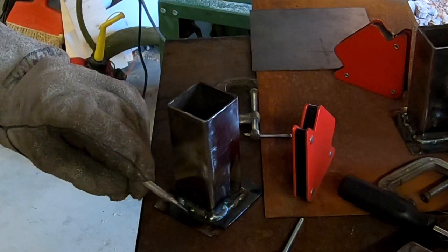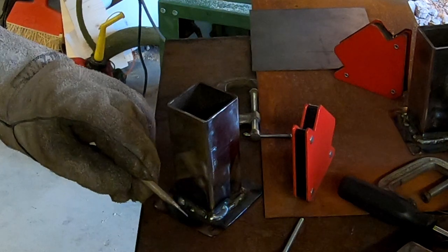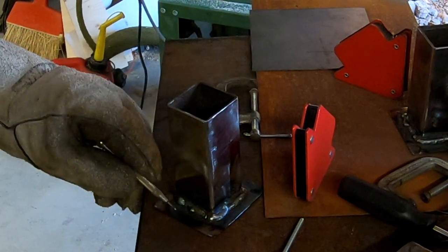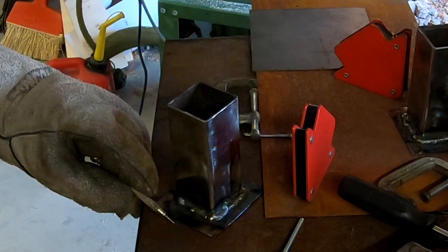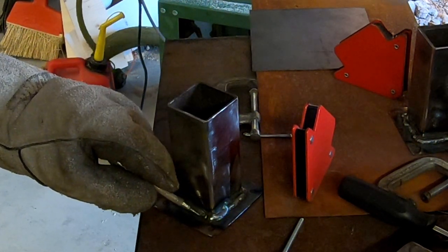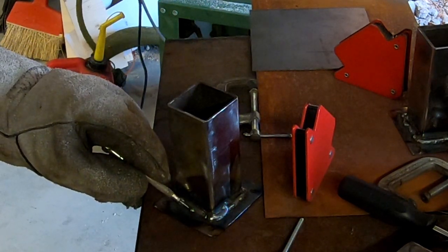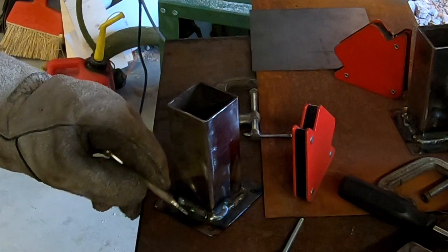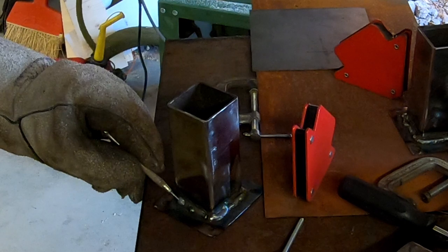Here we are on the second piece. I was still tweaking the settings. You may think you're a bad welder or something, but it may just be your settings. So I kept tweaking and I got better. I really like this half section right here. But when I come back I end up getting some overlap, which is bulky and thick — I'll grind that down. And out at the corner, I got bulky again.